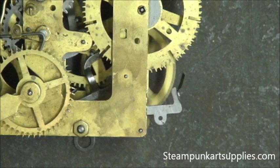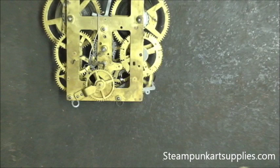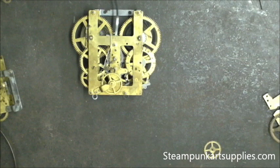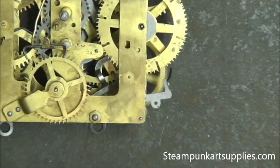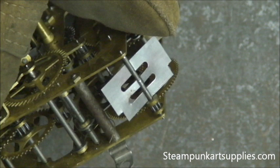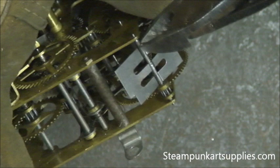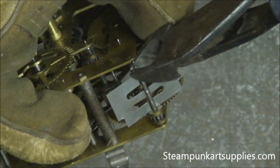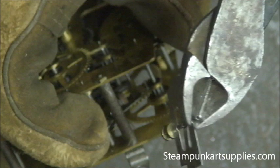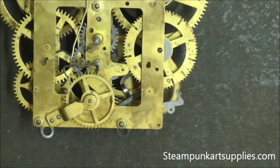Once that tab is bent, you could walk away and let it unwind on its own — the spring could be fully unwound in maybe an hour and you can come back and safely work on the other spring. If you want to go faster, you can pull the paddle wheel out by bending the plate out slightly. That plate has flex, so it pulls right out. With the wind resistance limiter gone, it unwinds a couple of times faster than normal.